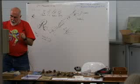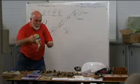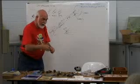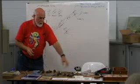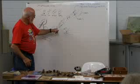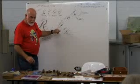Now when you try and engrave with that very straight edge, you want to cut in and then you want to come out again. When it's just left like that, it'll just keep on going down, it'll want to go out the other side of the metal. I used to joke to my students that it wants to go to China. The fact is, when we prepare the gravers, we pay a lot of attention to the heel and the belly.